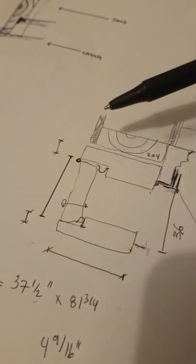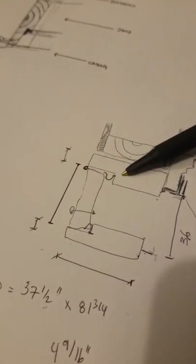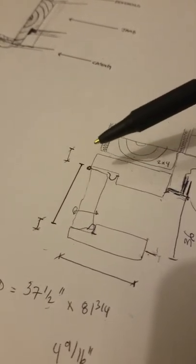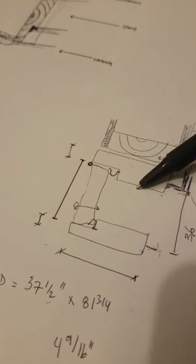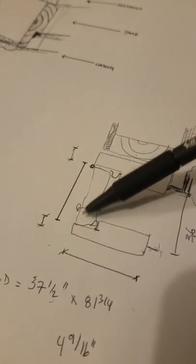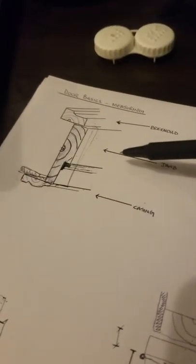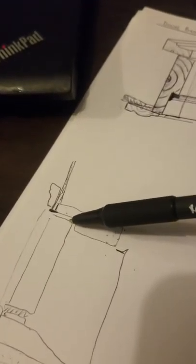This is the easiest way to measure any exterior door, and the same logic can apply to interior doors with some changes. For interior doors, you can no longer assume three-quarters here and an inch and a quarter for the sill — interior doors use a flat jamb without the bevel. So it's three-quarters and three-quarters: measure inner to inner, add an inch and a half for unit width. From the floor to the bottom of the head jamb, add three-quarters of an inch for unit height.